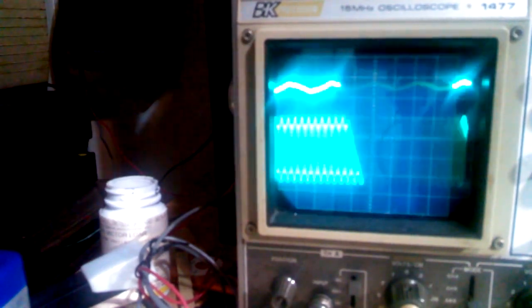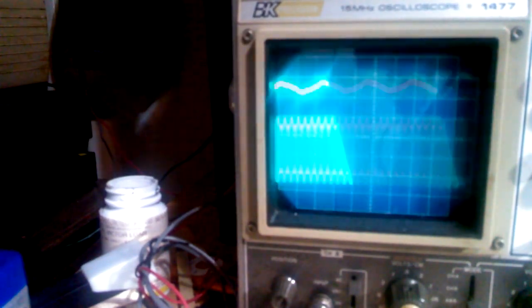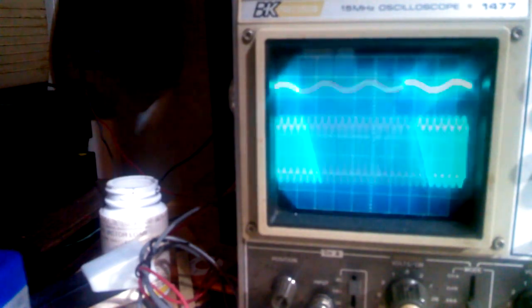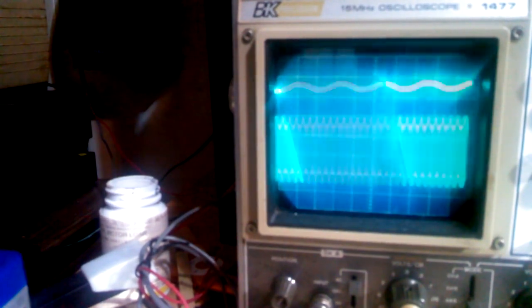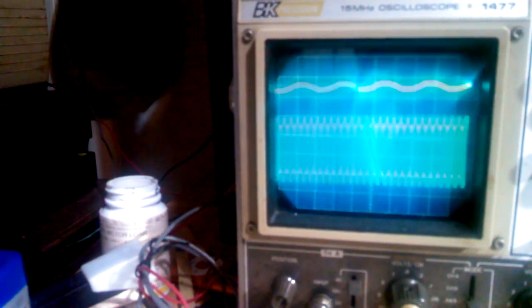See, I can do several things with this coil. I can put a slug in it. When I do, look what happens there. But they interact with each other. And that's what happens in our transformers, which is basically two coils in our radio. The first one has a signal and the second one picks it up. Now the whole deal is they have to be wrapped pretty much the same and they have to be in tune. That's when we adjust those slugs, we get them to where it comes over with the best optimum signal that we can get.